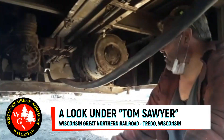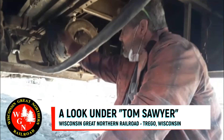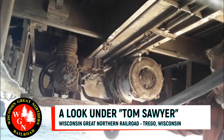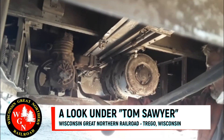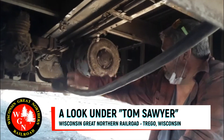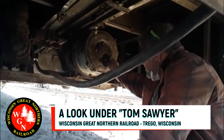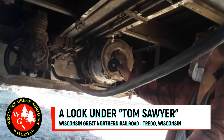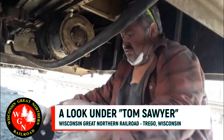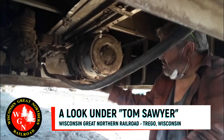What is that huge tank behind you? That's old, right? That is the old motor, and that is the old pump for the old air conditioning unit. So that would be original 1930s — yep, that would be original. Hard to believe how big that stuff is. Why would there be a motor underneath here? A motor to run the pump. And the pump is for? This is the pump that would have run the Freon and everything through the units — a big electric motor that had five belts on it that ran that pump. Nowadays a motor this size can be replaced with something much smaller. It just took a lot to run that giant pump.